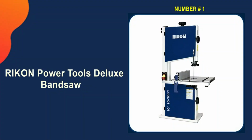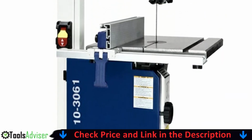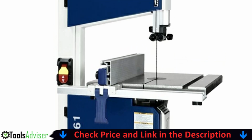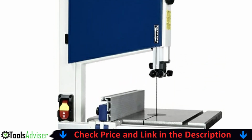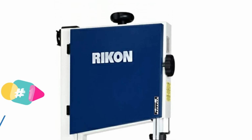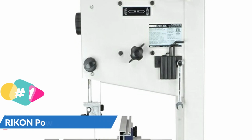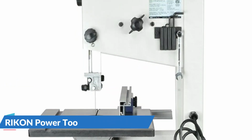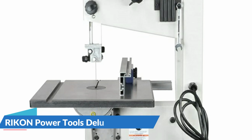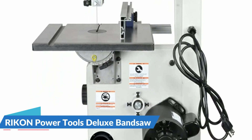Our number 1 choice is the Rikon Power Tools Deluxe Bandsaw. The new and improved Rikon Power Tools 10-inch bandsaw 3061 is a replacement of our previous 306 model. Numerous features make this bandsaw extremely easy to operate and make adjustments to the blade, guides and fence. The increased cutting capacity, 2 blade speeds, and increased half a horsepower motor are quite ample for smaller projects, and will be appreciated by woodworkers having limited shop space for a larger size bandsaw.